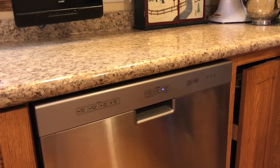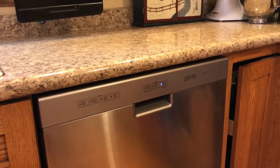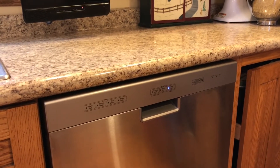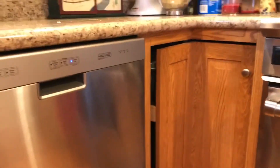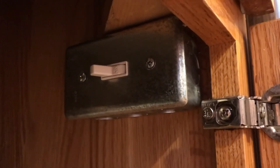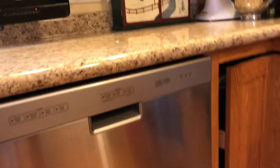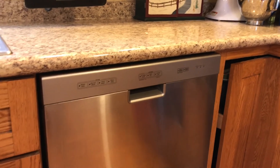There are people who have replaced dishwashers just because of the way it acts — it won't respond, you press buttons, it acts funny — they say their dishwasher is bad, bring a plumber in, spend big money, and walk out with a dishwasher that's perfectly fine. It just needed a power reset. So you get two benefits: the kill switch wired in close by so no one bumps it while dishwashing, and when you're done just shut it off so you're not drawing any power. Thanks for watching.